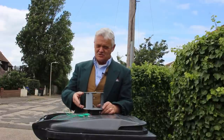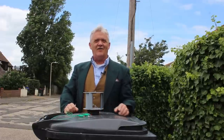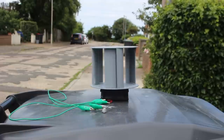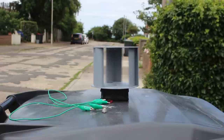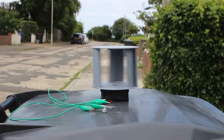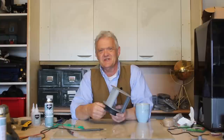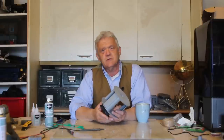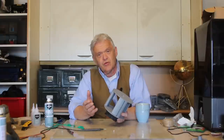We've come outside, glued it together, and stuck it on the bin with the wind coming from that direction. There's not a lot of wind, but let's give it a go. It was a shame it didn't light the LED, but to be brutally honest, any turbine this size in those wind conditions isn't going to light an LED. It's 10 centimeters by 14 centimeters and wind speed was around two to three meters per second, so we're expecting somewhere around 20 to 60 milliwatts — that isn't going to light an LED. It won't have got above a volt, so it didn't reach the turn-on voltage. But it was in real conditions and under load, so we can say the thing actually functions.